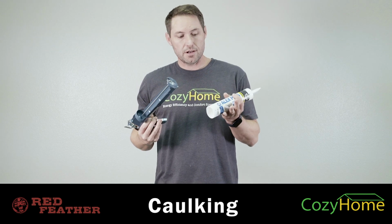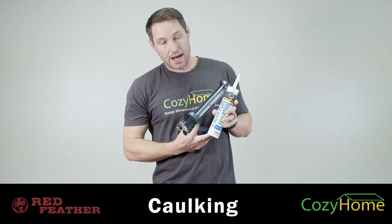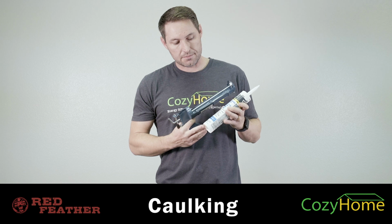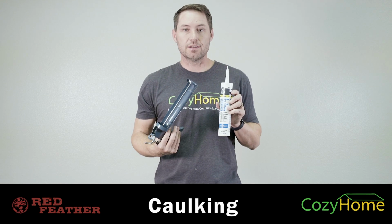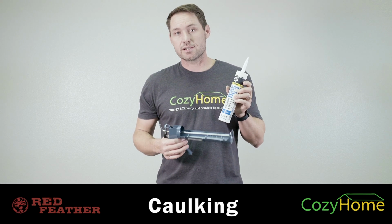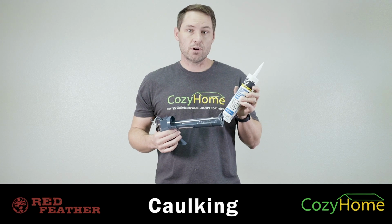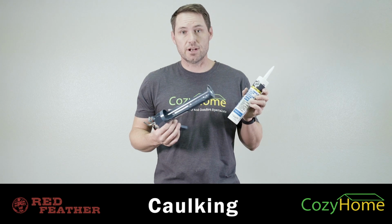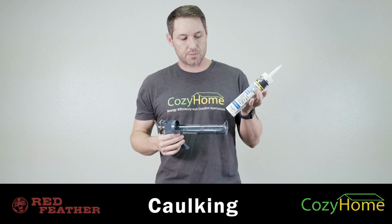Next we have a caulking gun and a tube of caulking. This caulking is made by DAP, and it's called Alex Plus, and it's a silicone enhanced product. So it's actually an acrylic latex caulking plus silicone. So it has silicone in it, but it's not 100% silicone. A lot of the silicone products may last a little bit longer, but they aren't paintable. So whatever color of the caulking you put on, that's kind of what you're stuck with. You can never paint it. Whereas this stuff is paintable and still lasts a long time. So that's why I like this product.